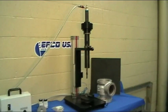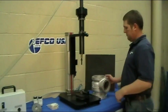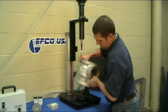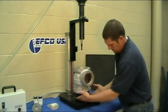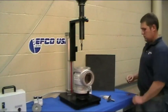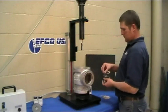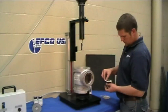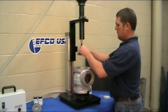This is the EFCO TSV-150, designed for lapping valves. This type of safety valve is ideal for the TSV. First, place the valve into the three jaw chuck which centers the valve to the machine. Next, attach the correct size lapping disc to the spring loaded spindle. Different grit abrasives can be applied to the lapping disc to achieve the desired effect.